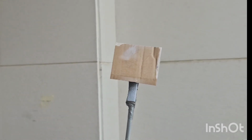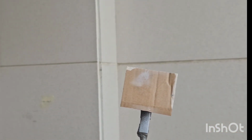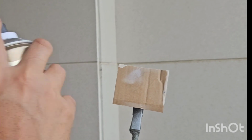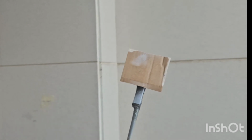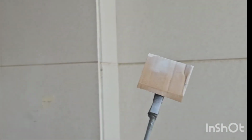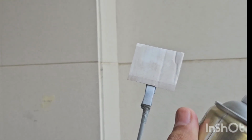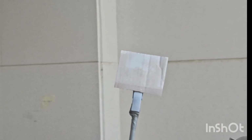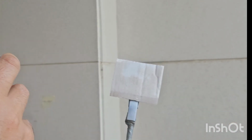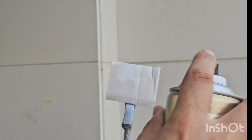And my spray pattern will actually start from way outside, come inwards, and go right across as far away as I started from. The actual idea being to ensure that the conical pattern that we discussed in the theoretical example earlier ensures that you get maximum coverage. And what you do is you come in from here, you start pressing it from an offset position from the cardboard, and you spray it, and then leave it. Once you're out of it, come back again, press it on the offset position, spray it, and go out.